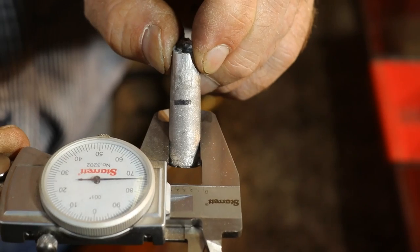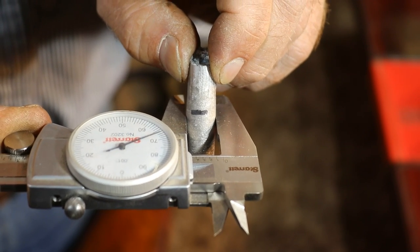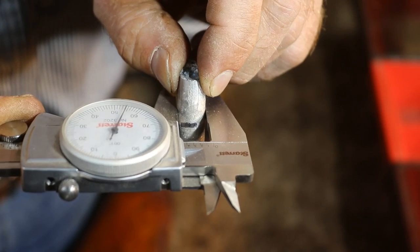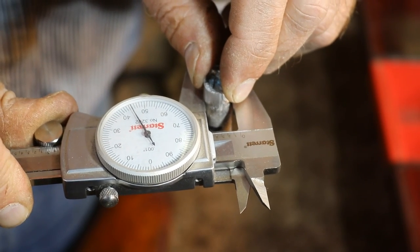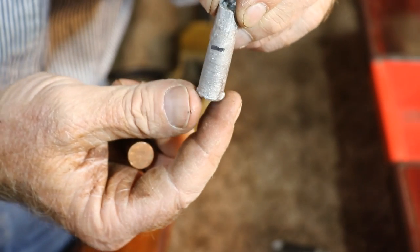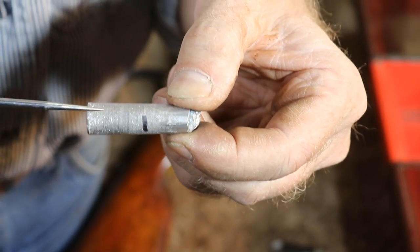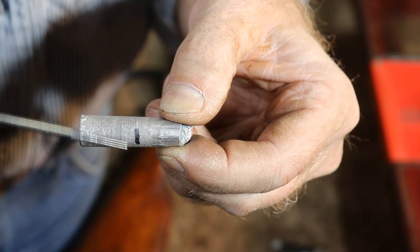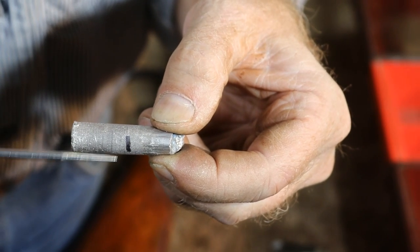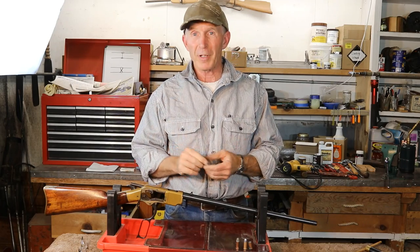We're at 474 — we would expect to be in the 440 range. Further along we're at 472, then 468, and through the free-bore portion of the barrel we're at 455, then where we would expect about 444, which coincides perfectly with the outside diameter of the original Henry cartridge. We've confirmed our suspicions that this chamber is way oversized. We can see a lot of vertical lines going around, which means most likely this chamber was really rough at some time and somebody took a rough abrasive and cleaned it out, opening that whole chamber up. Thanks to this excellent chamber cast, we now know for certain that this barrel is unserviceable.